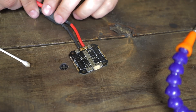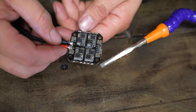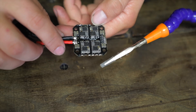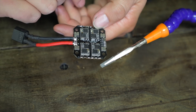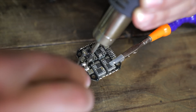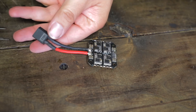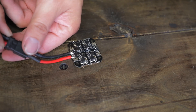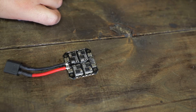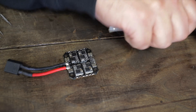Only those guys lit up. Nothing is getting hot on here. The only other thing I could think of is maybe one of these two processing chips — one of them went out. Not sure which one. We will remove one at a time and see if something gets fixed. These are very difficult to remove without ruining any of these other small little components on the board. I'm not really looking forward to doing this. This is all resistors, these are caps — everything looks okay. Right now we're just guessing with whatever available parts we have.